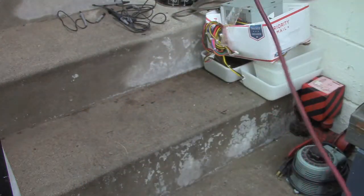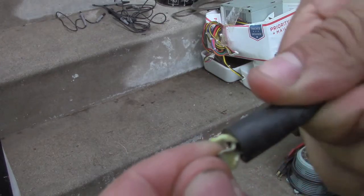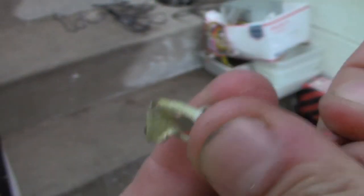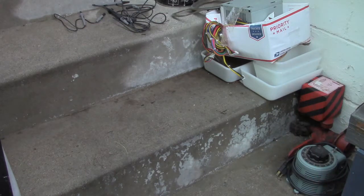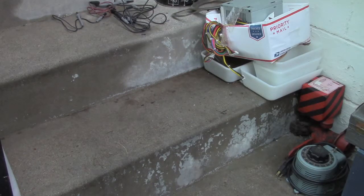Personally, I like the old test leads. They were just heavy-duty rubber with actual wire in them and not some mysterious material. Most of those were rated at several kilovolts. A good rule of thumb is: don't buy any test leads that the manufacturer can't provide a data sheet on. That leaves out probably about 90% of the test leads on the market — eBay just went down to about three sets of test leads instead of 30 million. I can only think of three manufacturers that I've ever seen data sheets on: Mueller, Pomona, and Fluke.